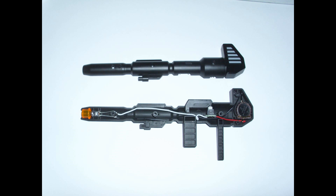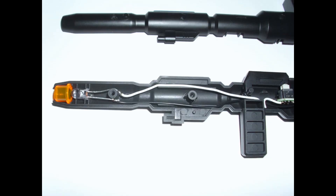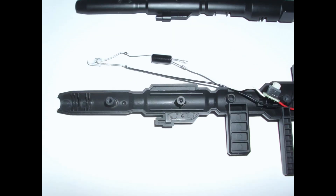When we open up the gun there is a very simple circuit in it: an LED connected to a white and black wire, positive and negative. We can just cut either one of these wires and solder the tilt sensor between the severed ends so that the electricity has to make a detour through the tilt sensor.